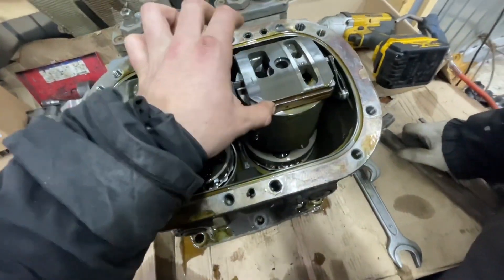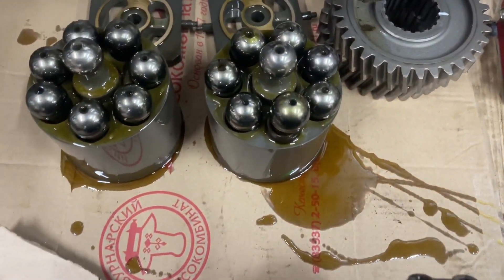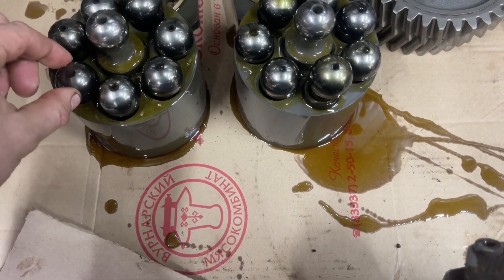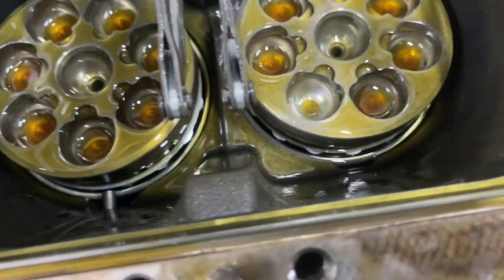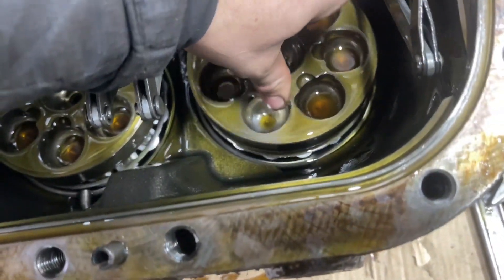So I was a little bit proved wrong. I said that side, or maybe that side too, but this one rotated very easily. That's the reason why the oil seal keeps leaking. Here's the bearing cage — look what happened to it. And here are the bearings themselves.